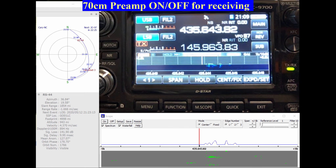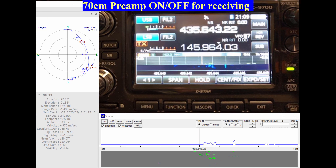You can see the preamp has a significant impact on my reception. I can't say what it'll do for you with your situation, but I have a hundred feet of LMR-400 running to the shack from the preamps, so it definitely paid off — for the 2 meter preamp and even the 70 centimeter preamp. Some folks say that it generates more noise and it's not worth it. My experience is that it does do that for some satellites and not for all of them. It seems to me that the noise level really quietens down when the satellite gets in range and you're just bringing in the signal more. I certainly would buy mine again, but I make no guarantees how it may or may not help you. Thanks for watching.